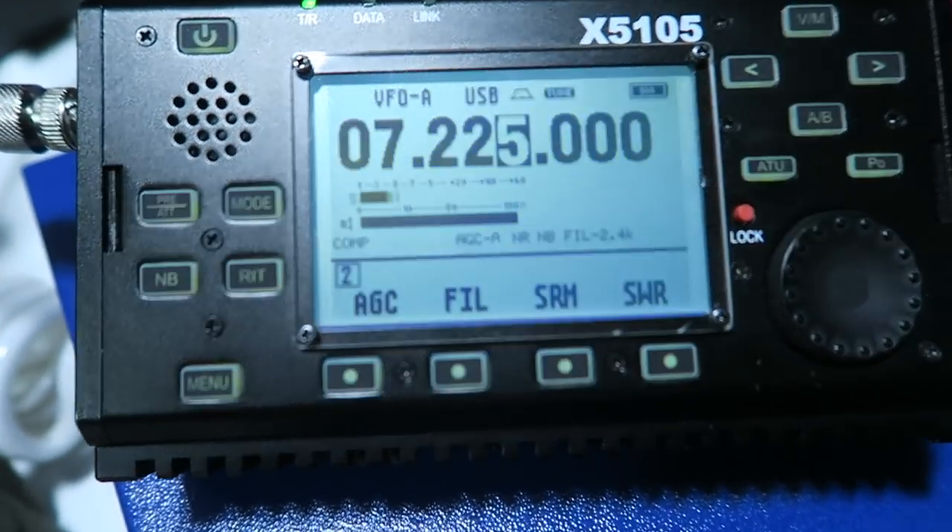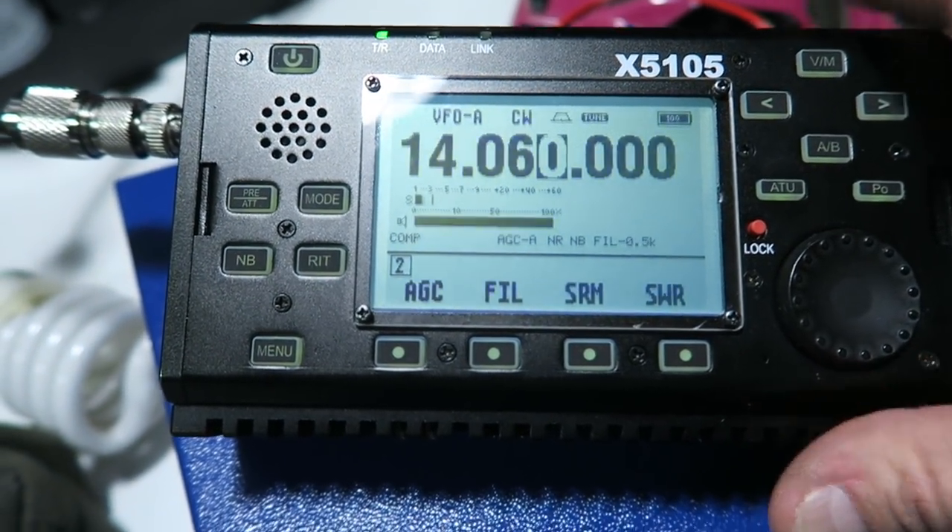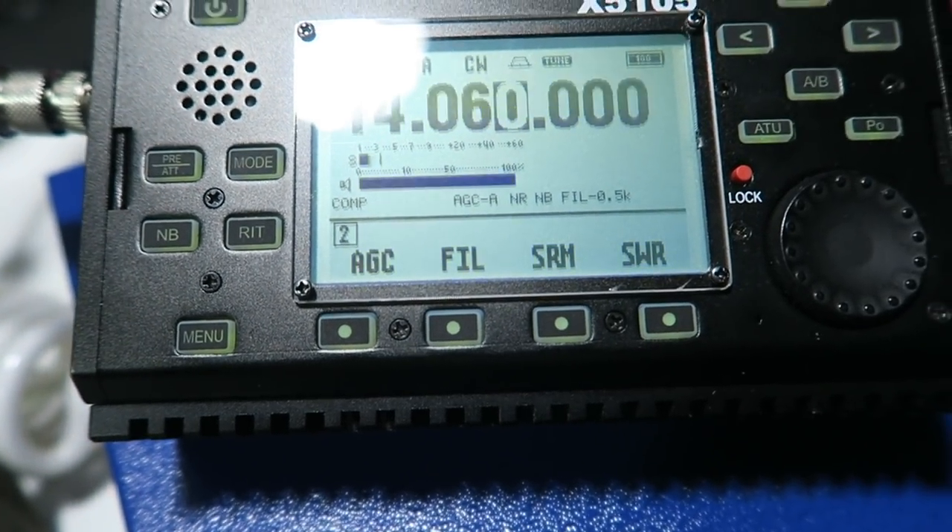Is this a permanent solution? No, but I never give anyone an excuse not to see what the SWR is like — with the Christmas lights off. I'm betting it's not great. An S5 on 40 meters. Let's see what it's like on 20 — an S3. Now this is the nighttime, so that will change tomorrow. One of the things that is difficult with an NFED like this is noise. And to Chameleon's credit, they do mention that in the instructions — you should indeed get it as high as possible. Getting it away from the RFI is going to help a lot. Obviously I have a Rube Goldberg type configuration for this antenna. Chameleon is very clear in some of the examples they give on what you should use. True to Chameleon's word, it took me about 30 minutes — not including setting up the camera and taking the shots — to set up the antenna, including putting it on a pole. It's very easy to set up.